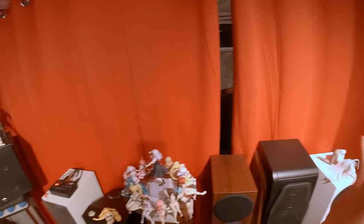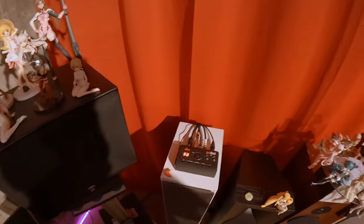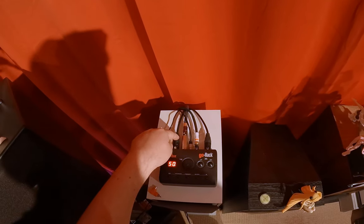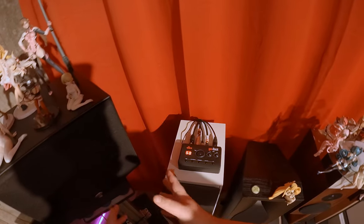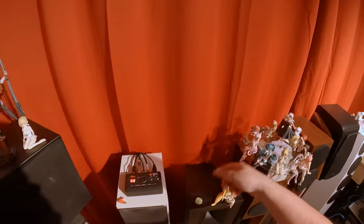I'm using an XLR cable to an XLR splitter to plug into both XLR inputs on the HSU, because if you have two RCA inputs — one labeled LFE — you get a splitter and plug both of them in to get more voltage to both. So I have two subwoofers back there: the HSU with an XLR splitter, and the Klipsch 1400 SW which only has RCA inputs, so one output goes through an adapter out to an RCA cable for that sub. I just go back there and turn off whichever sub I want to use at the time.